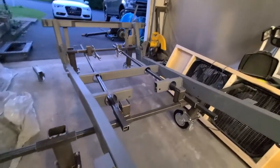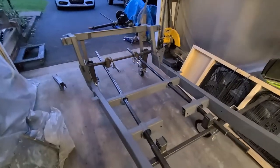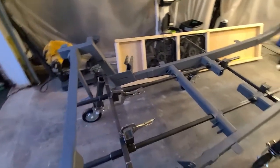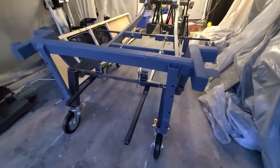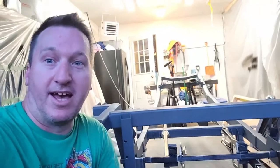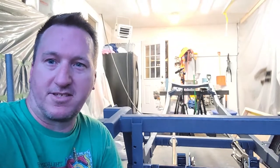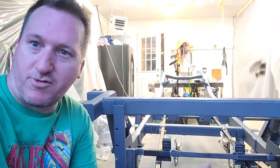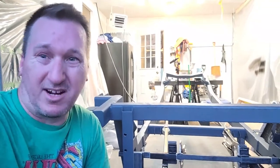That's probably the best news I could think of, simply because there's going to be a 500-pound car body sitting on this after the frame is done. For now, we've got the frame testing out the rolling cart because I'm getting ready to spray color. I really just wanted to make sure that I positioned it in a way that I could spray as much of the frame as I could without any areas I'd have to touch up later because the stands were in the way. What I've actually used is the exhaust through holes — just ran the pipe straight through the middle there, because I don't really care what the inside of those through holes look like. The exhaust is going to be in the way anyway. Aside from that, I can pretty much get around the frame and get ready to paint.